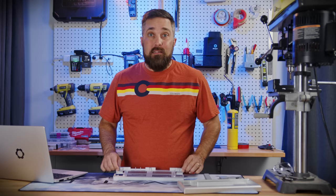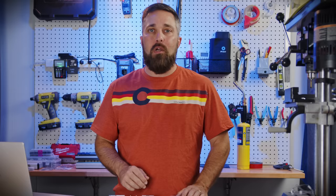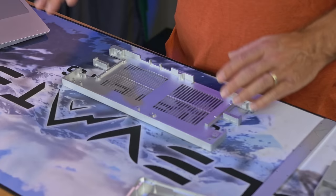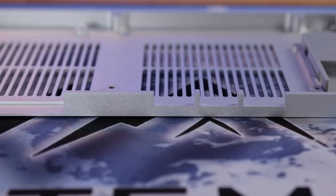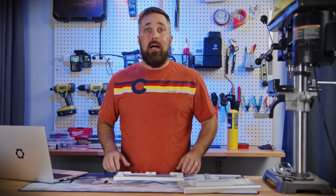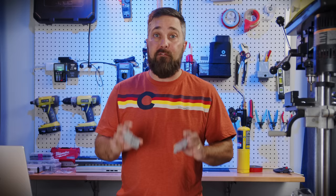The mainboard case as designed required machining from three different planes, which was entirely cost ineffective. So completely cutting out the expansion ports, ventilation ports, and the Wi-Fi antenna mounting location allowed the part to be machined just from the top. And that's where the 3D printed parts come in. First, I have the expansion port enclosures, which will fit right in here.